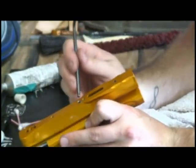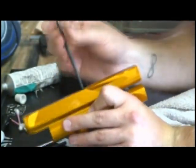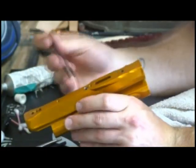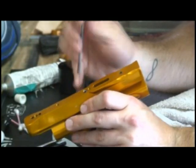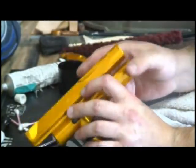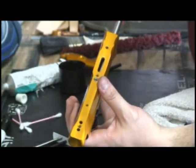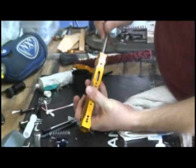If you're not flush, you've got this valve in wrong. I tightened that — I snugged that right up — nothing crazy. I don't go all insane and start ripping stuff apart. The reason why is that the screw is stainless steel and this is aluminum — stainless steel will win and you'll strip out the body, and that's very expensive, so don't do that. Once that's snugged down, I give it another little turn to make sure it's snug in the body.